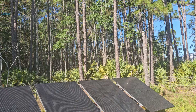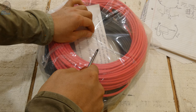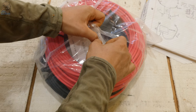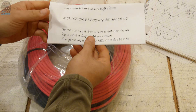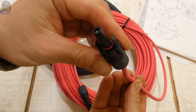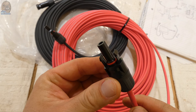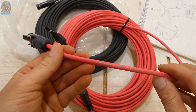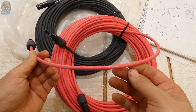Links to those videos are in the description if you want more detail. First let's talk about the PV cables. I went with 100 feet of 10 gauge cable — long enough to move the panels around if I need to, and thick enough to avoid voltage drop. I bought mine from a company called Temco on Amazon. It's not the cheapest option but their products have a good reputation. I also have their crimping tool. I'm not sponsored by this company or anything — I just had a good experience so far.